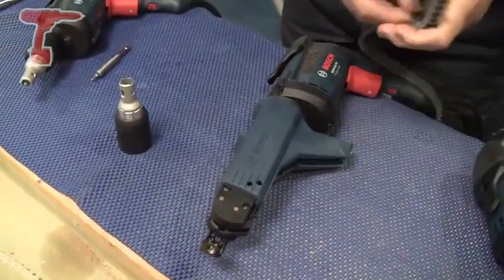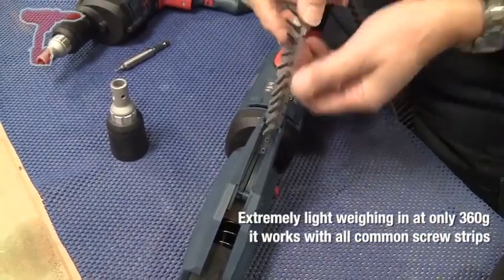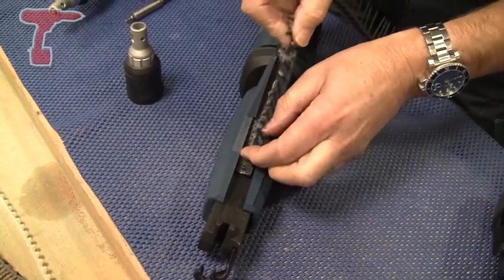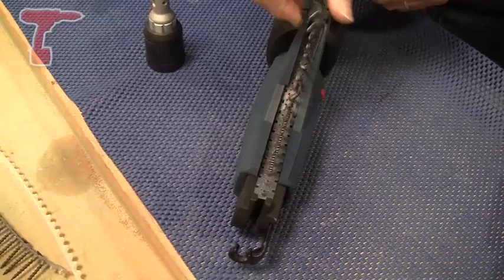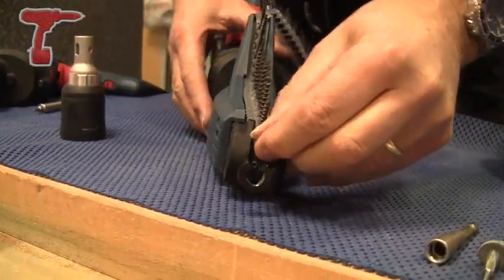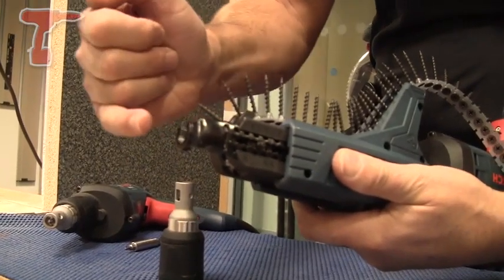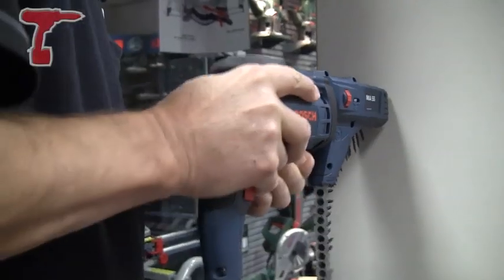This unit is compatible with any screws of the auto feed type, so it's not manufacturer sensitive. We simply feed the strip through into the machine underneath like this, and then through the front. As you get nearer the front, you start hearing the unit making little clicks. You keep the screw just off centre so that the first time you apply the tool, this first screw will be brought into line ready to be driven.